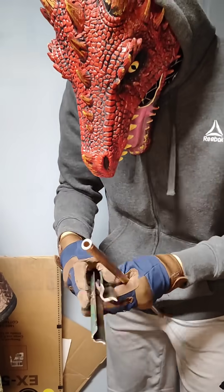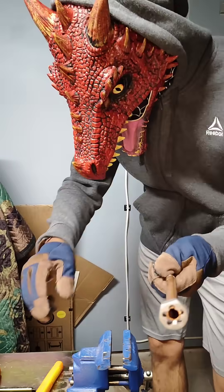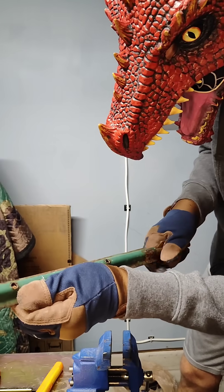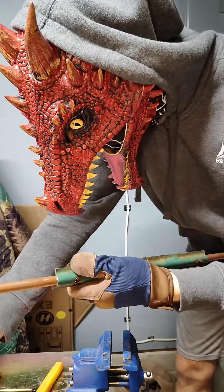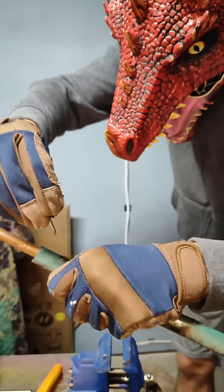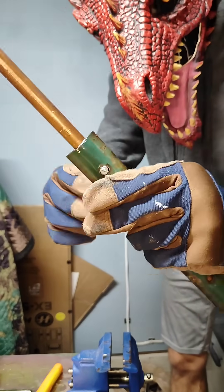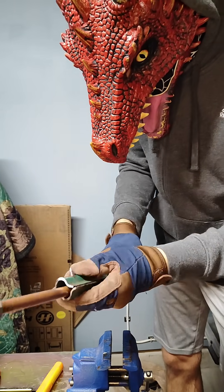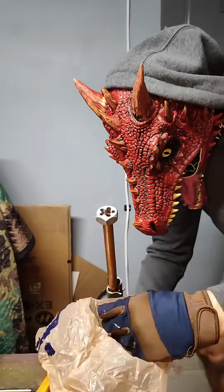Go check it out. In one of these plates I drilled holes so I could put a nail through, because friction alone isn't enough to hold the pipe in the vise. I insert the pipe into the plates, fix it with a nail, and now I place the whole structure in a vise.